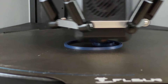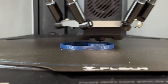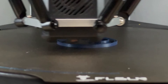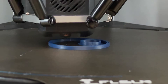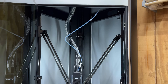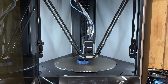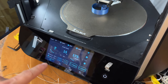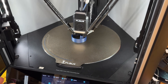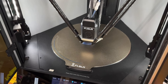This print has supports enabled and I think it's a 30 or 32 minute print over on the Adventure 5M Pro from FlashForge. It was a little over an hour, but that was out of PETG, so maybe not a completely fair test. The way I've got this set up right now is 175mm/s on the outer wall and 275mm/s on the inner wall. The infill is where it gets crazy — like 600 to 700 millimeters per second — but this particular piece doesn't have any infill, it's just walls.